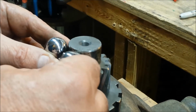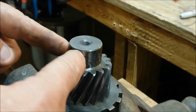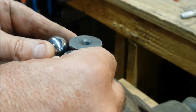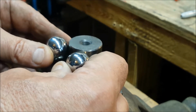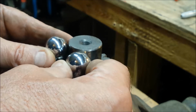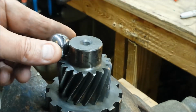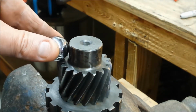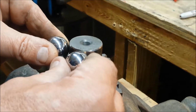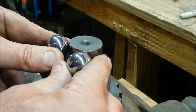So I'm going to take a diamond tool on my die grinder or a Dremel or whatever, and I'm going to make radius pockets. So when I do weld this thing, as a welder, I am not. But for art's sake, I can be. And to get more surface area contacted when I weld. I mean, I'm looking at that, and there's nothing. I don't know if you could see that, but you see all that light back there. So if I modify that a bit to make more of a contact, and then I'll set my eyes in there. At least that's the plan.